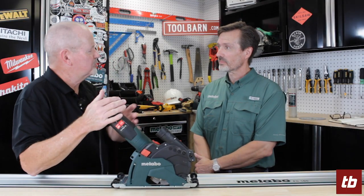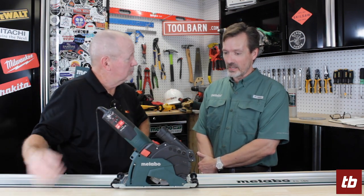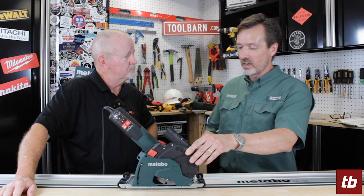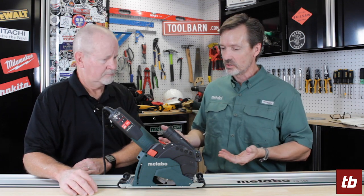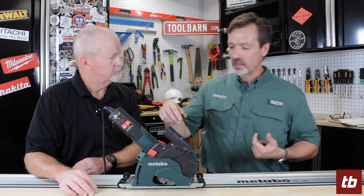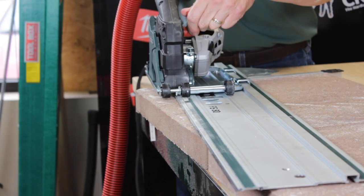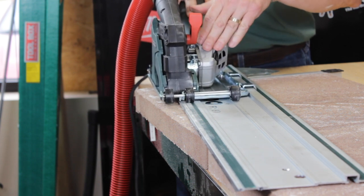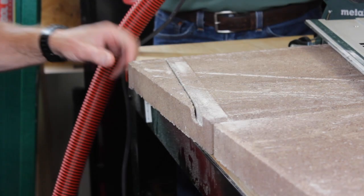The third tool looks a little bit like the saws we've been talking about, but it's not a saw. It's a grinder body mounted on a particular guard assembly. It is designed to cut and score concrete, block, brick — masonry in general. It has a five-inch diamond blade on it. Depending on how deep you want to cut, you release the lever, rotate down into the work, and then start your cut. It was designed to be used with the guide rail system. As you might notice, it has wheels on it and can be free-handed as well — it just depends on the amount of accuracy the job requires.